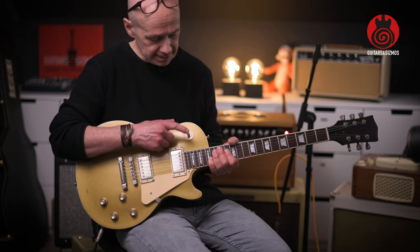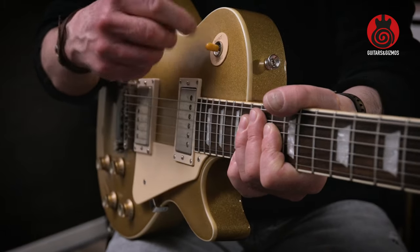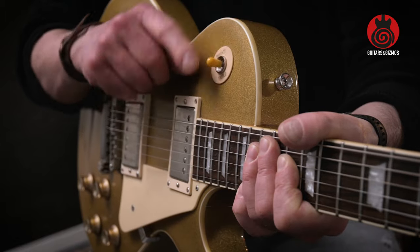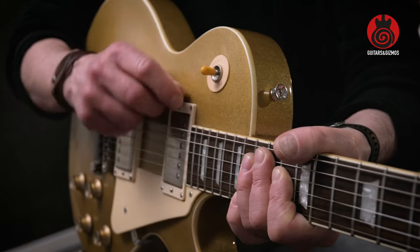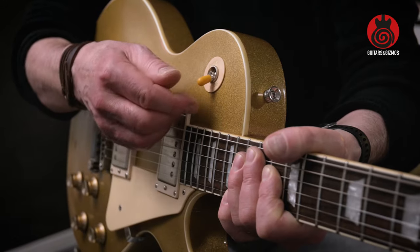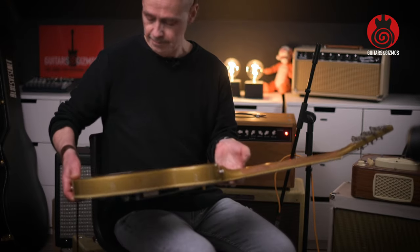Yes, one more thing, the switch here is also from that ES-335 that I have here. I changed all the electronics in the red ES-335 that I have. And this switch I thought would fit right in. And it does, but the switch itself is too short, or at least the top of it. When I screw this hood all the way in, it won't stay in the bridge position. So I have to open up the screws here to have it come out far enough that just the metal of the pin will go free of that ring here. It's almost on the last groove here, so it will fall off very easily. So I kind of got to glue it on here and just have it like that. I probably will, or else I will have to see if I can buy a new Les Paul switch for this. Maybe I'll do that later on.